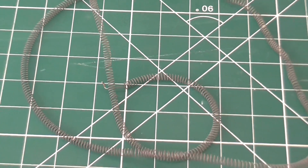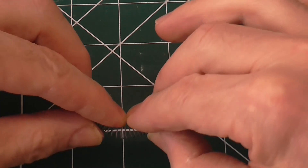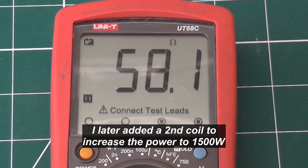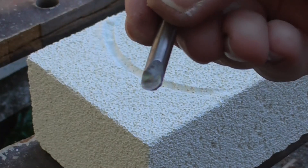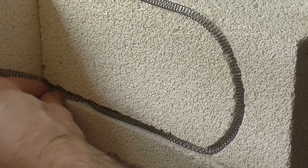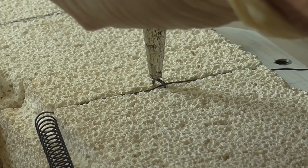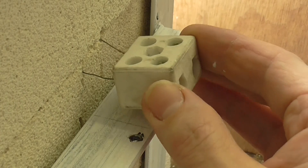I salvaged this element from an old cooker hob, but you can also buy nichrome wire online quite cheaply. I wanted the kiln to have a power of around 1 kilowatt. Using this formula, I select a length of wire that measures about 58 ohms. A groove for the coil is easily carved with a metal tool, and it's held in place with small staples. The ends are connected to a heatproof ceramic terminal block.